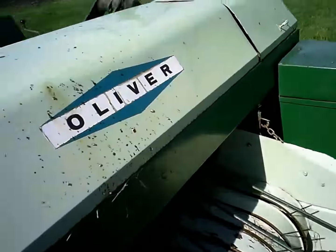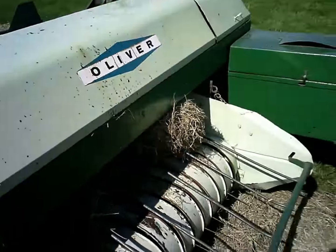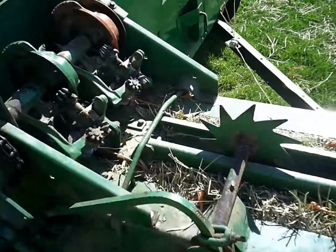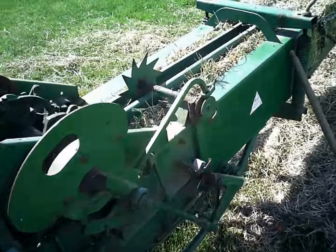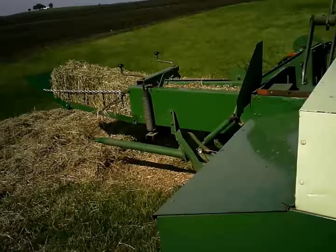Today's Thursday. I was thinking about mowing hay yesterday but it rained again, so I didn't do that. It did not tie. Well, I'm going to come back here and get this straightened out. Actually it did tie — it just didn't get it off the bill hook for whatever reason. I'm going to try it again and see. I had to readjust the twine disc again on the right knotter, so I did that.